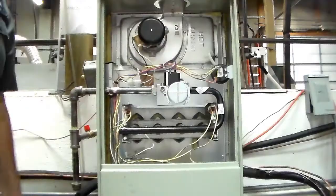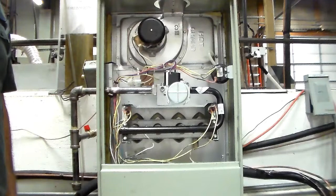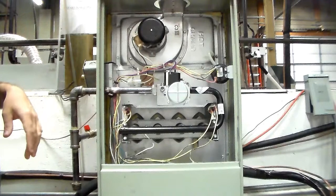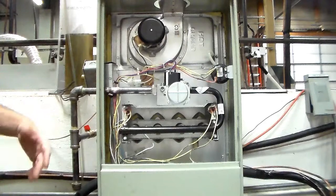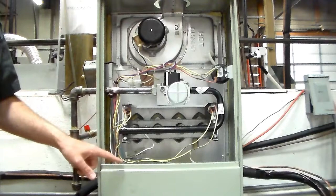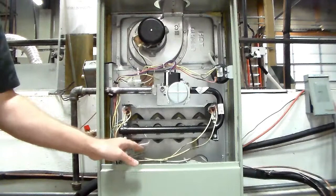Safeties and parts — I'll do this on a different furnace so you can see that a lot of this stuff is in the same place. This one up here doesn't have a vent safety switch, so if you don't have that on the unit you're looking at, you don't have to mention it — only talk about the parts you do have. Down here behind the door you always have a door switch.